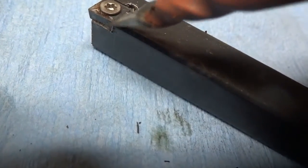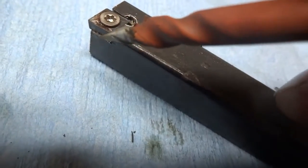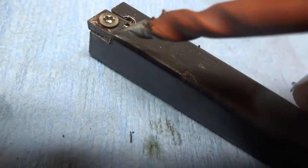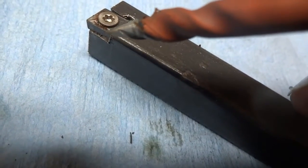This should be over the top, but the insert surface is proud — meaning the holder surface is sticking up above the insert. So we've got to take a little bit of metal off here, not much at all, and then we'll go try this out.